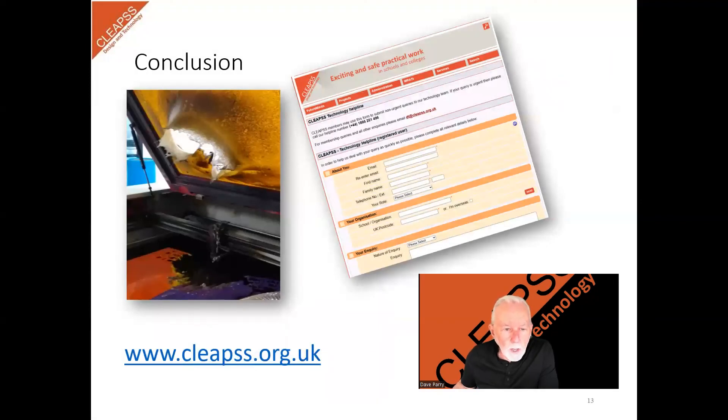In conclusion, there are a couple of important points to bear in mind whenever you use a laser cutter. The main risks come from fumes and fires. These can be controlled through use of an effective extraction system and constant monitoring of the machine when in use. If, while cutting, you notice there are flames, you should pause the laser. If the flames do not immediately go out, turn off the machine. The extraction system should cause the flames to be extinguished. If this does not happen, you will need to extinguish the flames with a dry powder or CO2 extinguisher. If the flames get hold of the material, you should immediately evacuate the room and follow your school fire drill procedure.